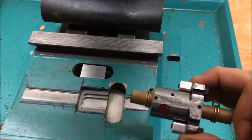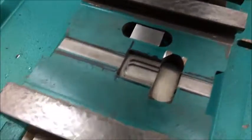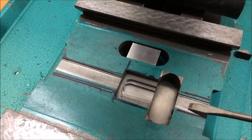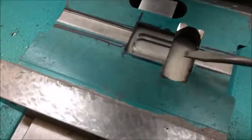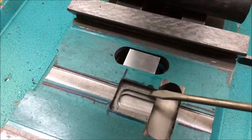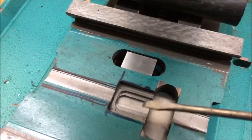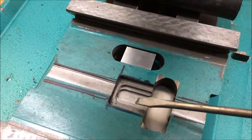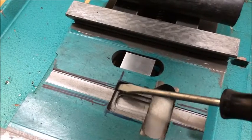I had to grind some relief on both sides of the ball nut and I had to relieve the saddle quite a bit. I ran about 75 thou deep groove down here to clearance out for the ball screw, and I cut two pockets. The first pocket was 200 thou deep, wasn't quite deep enough, so I cut another pocket 300 thou deep and a third pocket at 350. I would say the 300 thou is deep enough for the clearance for these.